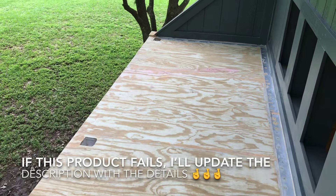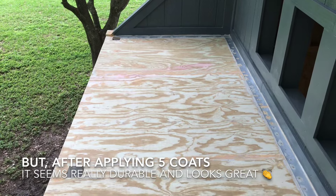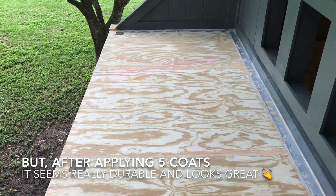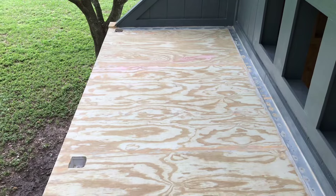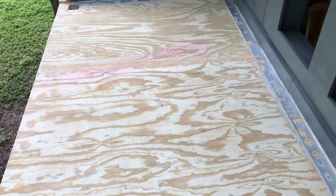To begin the process of applying this product, I have sanded this exterior grade plywood smooth. It's been exposed to the elements — bird poop, bugs, lizards — so I wanted to get all the oil and dirt off. I sanded it with 40 grit sandpaper and also filled in the joints, seams between pieces, and the nail holes and screw holes with Minwax wood filler. I'll put a link to that in the description.